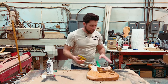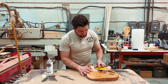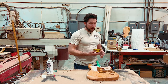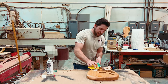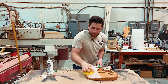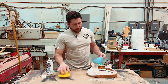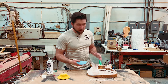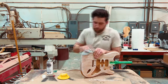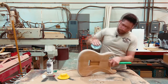You'll notice I'm mostly sanding linearly — that's just because it's efficient. Once I have my sealer built up, I can sand in any direction I want. But if you can keep your sanding direction consistent, it does help — it makes things a little smoother. You don't have to worry as much about crisscrossing scratches, so when possible, that is my preference. I'm going to get my edges done, then we'll wipe this down, check for low spots, and go ahead and get spraying.